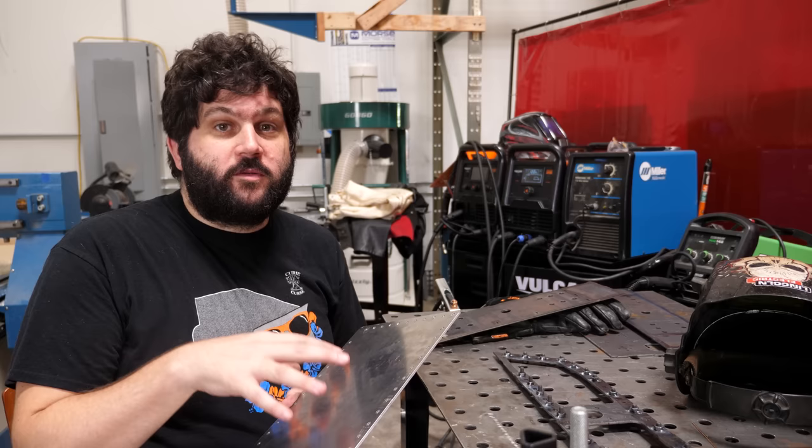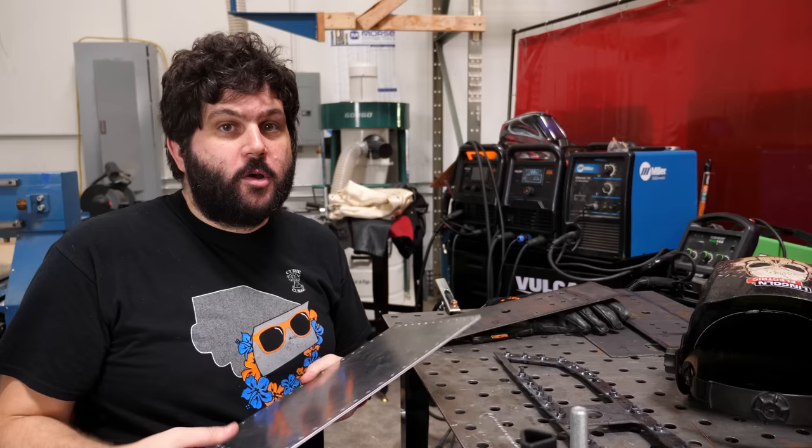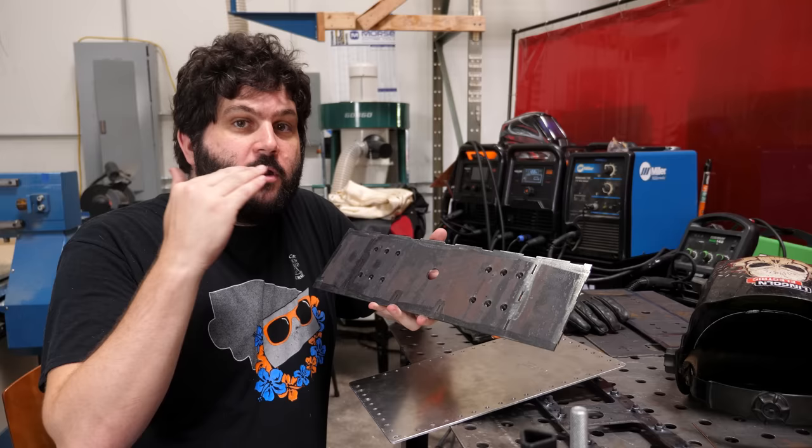We use aluminum because it's great and easy to machine and it's really lightweight for its size, for things like motor mounts and gearbox plates and things that don't take big hits. When aluminum takes a big hit, it does absorb a really decent amount of energy, but it tends to chunk apart and it makes repairability a lot harder. So for the frame and the armor of Switchback, we use AR500 steel, which is abrasion resistant and really strong. When this gets hit, energy will tend to glance off of it, or if it does absorb the impact, it'll either dent or bend, which is much easier to repair in the pits.